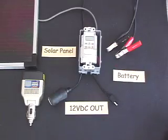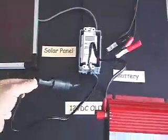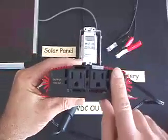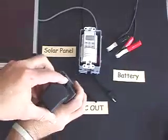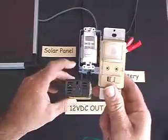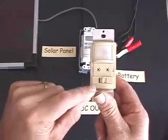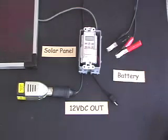Here's how we get AC: this is a 75 watt pocket power inverter. You'll see them at the auto store or get one online. A 400 watt unit like this one can also work. Just plug it into the cigar outlet and away you go — you've got 110 volt AC to do just about anything you want. This wall converter reduces AC power for use with something like a fax machine or a phone. AC also works great to power these motion switches, which have timers and light sensors in them for all sorts of limited applications.